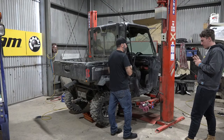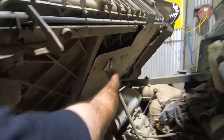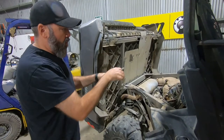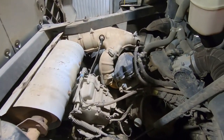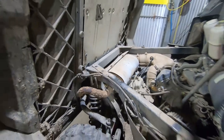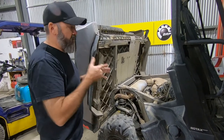One of the great things about the Can-Am Defender is the engineers have designed it to be serviced mainly from just underneath the tray. If you lift this handle you can get the tailgate up, but to really get in there you pull this little R-clip out and the tray tips right up out of the way so you can access all of the areas underneath the machine. Most of these machines come in from the farm uncleaned, and it can take an apprentice a couple of hours just to clean it enough to reach all the inspection points. So if your machine's going into the dealership, give it a clean first.